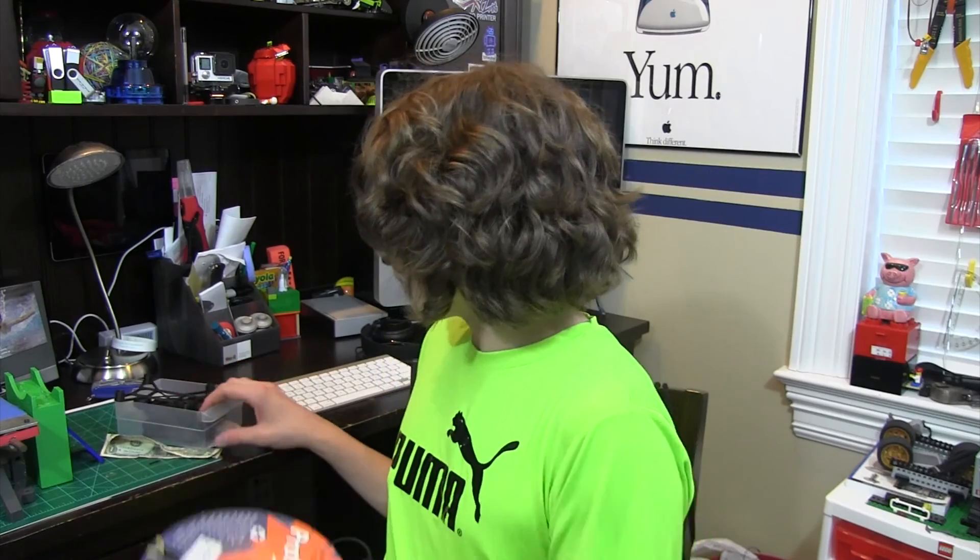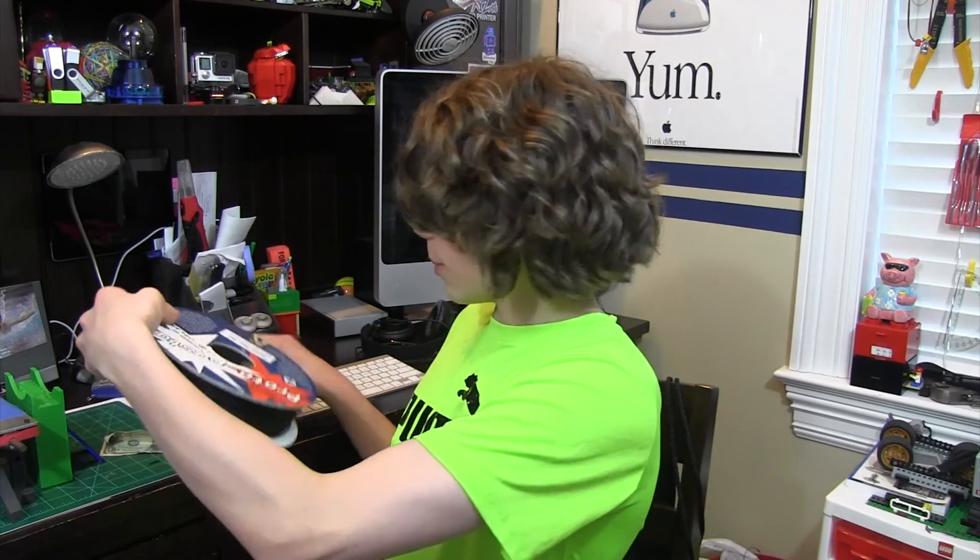The spool is really nice also because it's just cardboard, so you can recycle it. The print temperatures for this are just regular PLA temperature. I printed this like it was just regular PLA and that seemed to work — anywhere from 200 degrees Celsius to 230 degrees Celsius would work. You don't need a heated bed, but if you want to put one on, you can do that too.